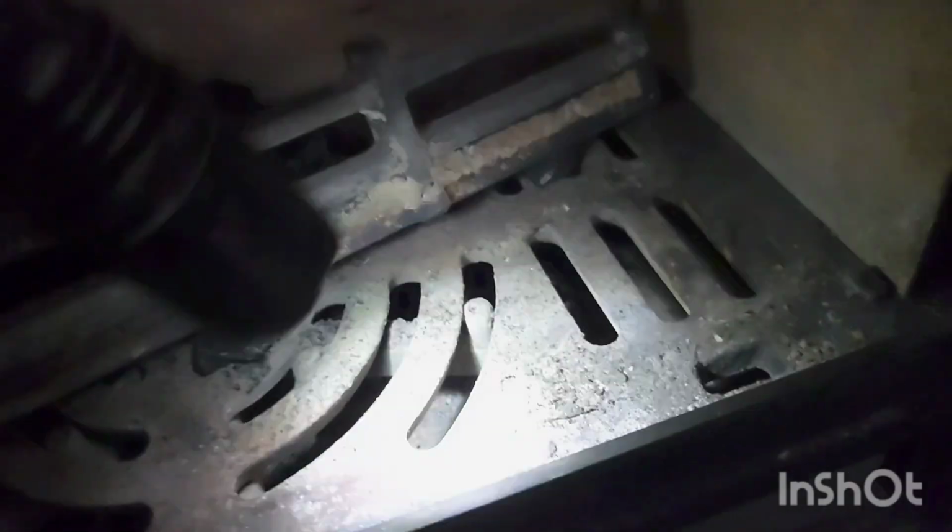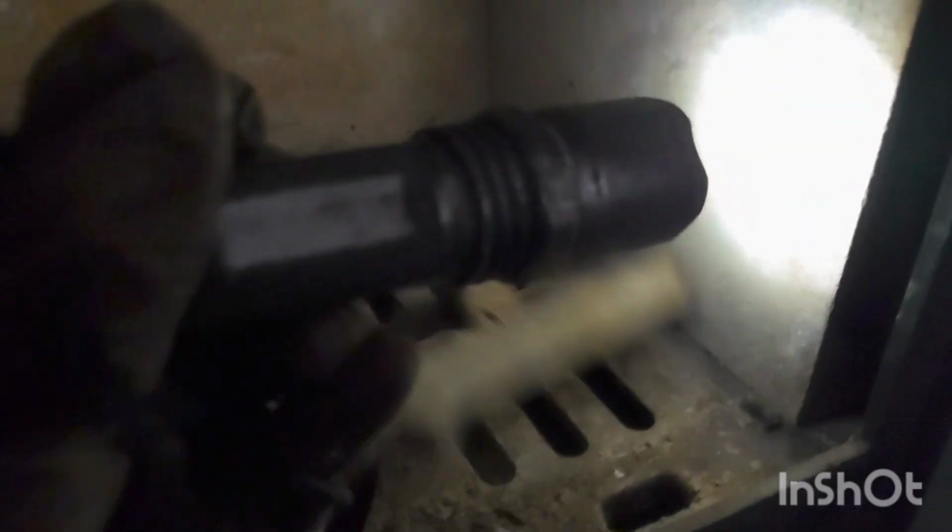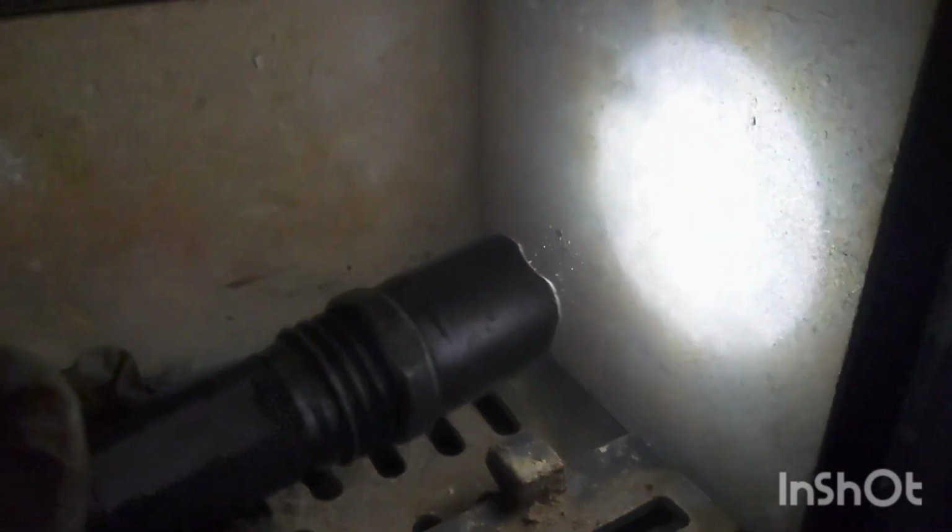So if you ever need to take these out, you take this bit out first, this guard out first. It literally lifts off. Very self-explanatory where it goes. See, there's holes there. You take that out, and then what you do is, this is a great wood burner. It's been really thought out how to get the bricks out, because you've got a gap on the side here, and then basically you can put your hand in here and then you can pull it out. But make sure you lift this bit up first. See, that moves up like that, and then pull it out.